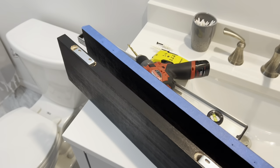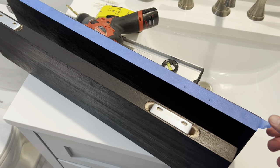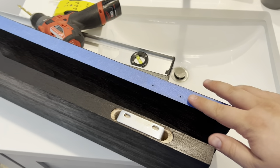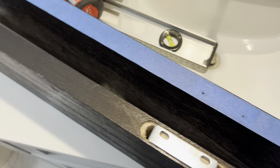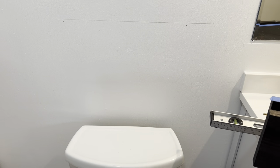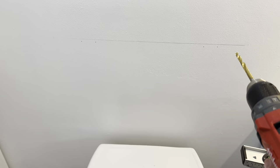So you've got your floating shelves — we're going to be installing three, just have two in here at the moment. The first thing I did is take a piece of tape and lay it along the back of the shelf to make a template for where each of our holes are, because we're then going to transfer those four holes to the wall where we have it marked for our first shelf. That's about 18 inches off the top of the toilet. My wife wanted it two inches above the bottom of the mirror, so that's what we're doing. Then I take that tape, put it up against the wall, mark those holes, and those holes are where I'll start drilling with my quarter-inch drill bit.